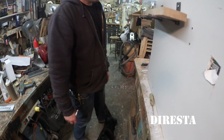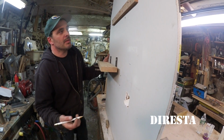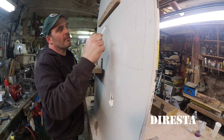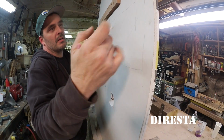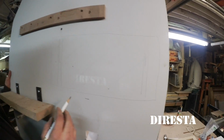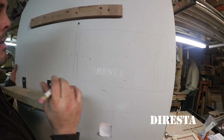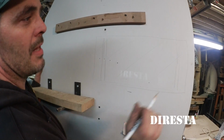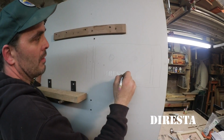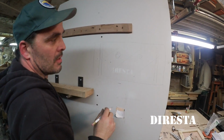Chill out. A lot of times when we hang flat screen TVs, which I don't like to do, but on occasion we do, we find the stud wherever the two studs are. So we've removed all the sheetrock in front of two studs, so we have two nailers. And then we take a clean piece of birch plywood and we replace it. And when I say clean piece, so that we could spackle it in and paint it in. And then we have a perfect nailer for that TV. Those brackets might only work from here and here or here, and you have a nice strong nailer that runs to the two nearest studs.